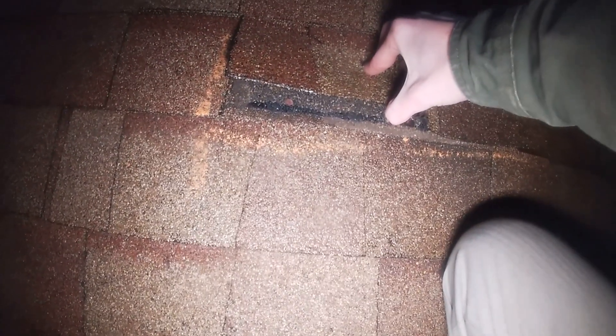I know we touched briefly on the ventilation and you're definitely right. The ventilation is causing major problems because that shingle right there, that adhesive is basically gone. And the nail exposed is also getting water underneath it. And it's like a stalactite that just takes water and it just drips down right into your wood, causing more rot.